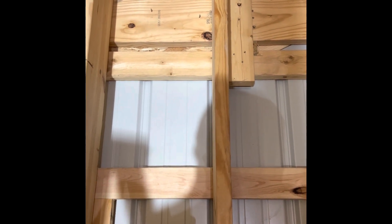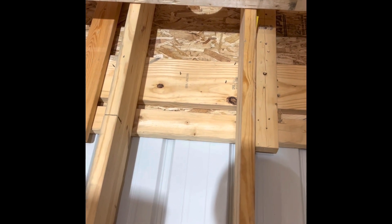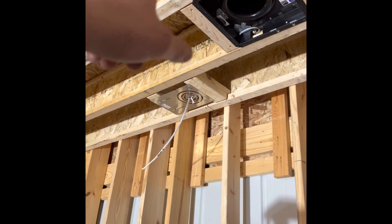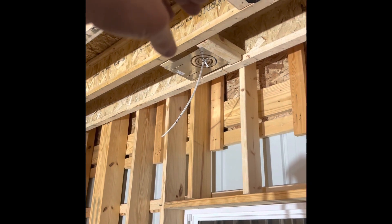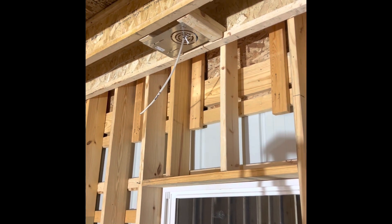I'm not sure how inspectors feel about it coming out of a soffit, but I want as few perforations out of the roof as possible. So I'm going to get some six-inch vent, put it out that way, and then put a soffit vent on it — it'll just come out there with a vent on it for now since I don't have the soffit in. It took over an hour to figure that one out. I had to make up braces to hold it in place and little tiny shims to have enough to screw that little flange to. These just sit on the I-joists and I'll screw them in from the top; the vent kind of keeps it in the exact place it needs to be.